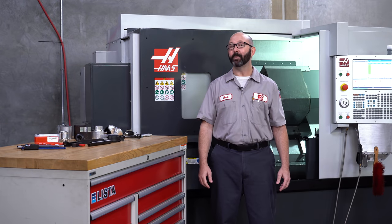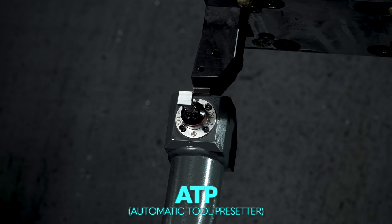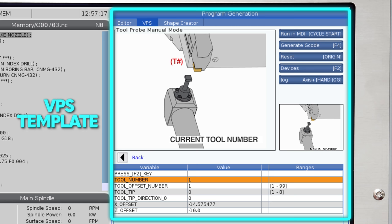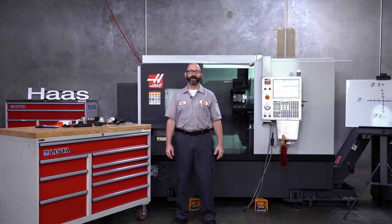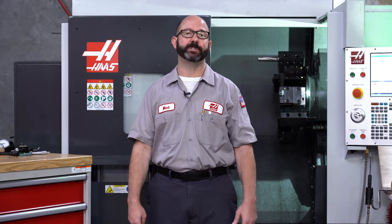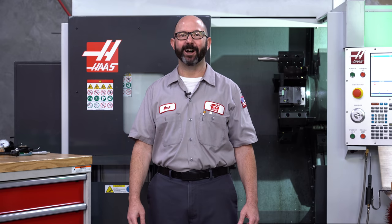This is not a video on probing, but if you've got the automatic tool presetter - the ATP arm - you're not going to be using the X diameter measure or the Z face measure buttons when setting your tool offsets, and you're also not going to need a micrometer or bore gauge when setting up your tools. All that measuring is done for us by the control if you've got that option. You will still need the Z face measure button, but only when you're setting your work offsets. Well, that is it until next time. We hope that this video goes a long way in helping you get up and running on your new Haas lathe. If you did get something out of the video, subscribe to the channel, hit that like button, and check out our lathe certification program. Thanks for letting us be a part of your success and for watching this Haas Tip of the Day.